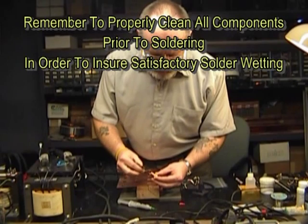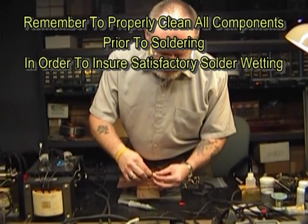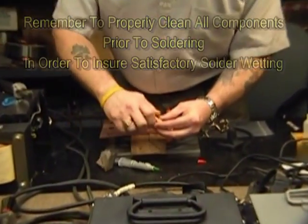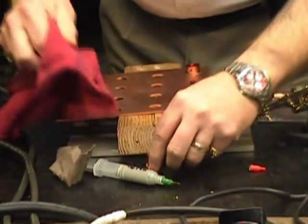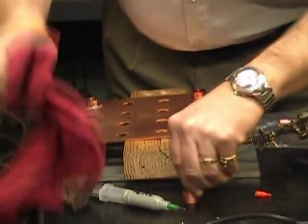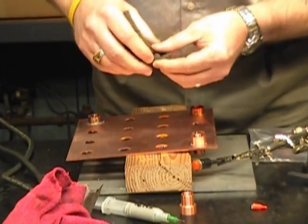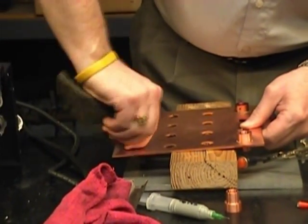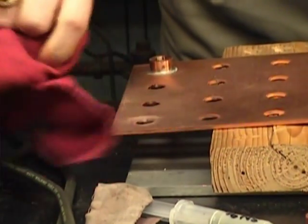This is new material, but you're always going to have a little bit of oxidation, so you're going to want to clean it just a little bit with some sandpaper before you do the soldering process — just clean off the residue. On the board we're putting these on, it's a good idea to take an abrasive pad and just clean that hole out, so that we know we're going to get good solder wetting. You can see the difference where I've wiped it and where it hasn't been — it definitely does have some oxides on it.